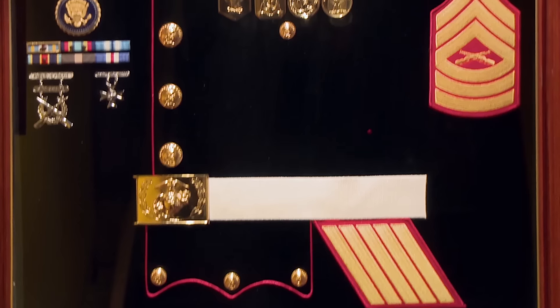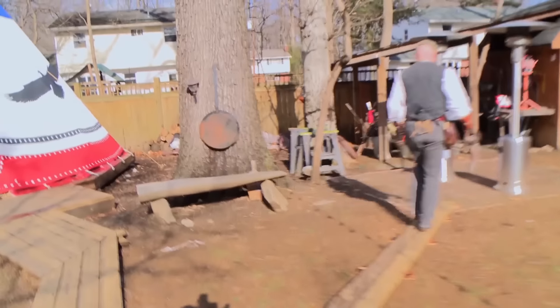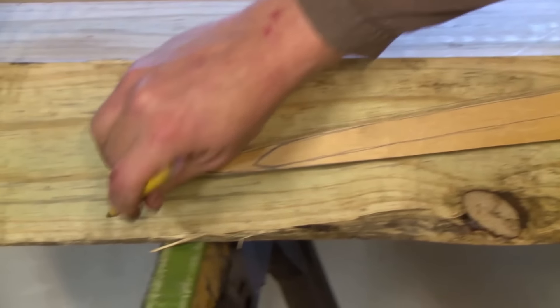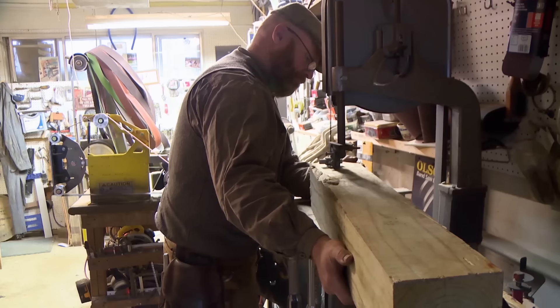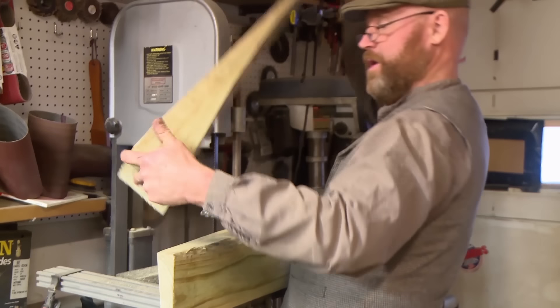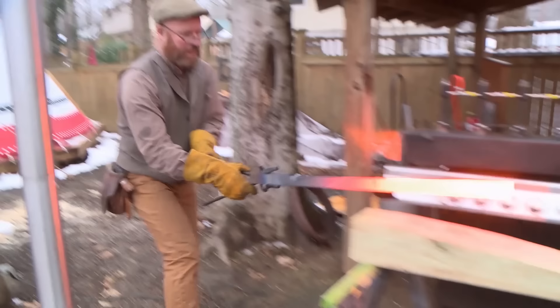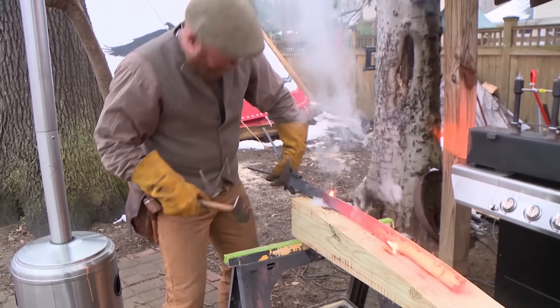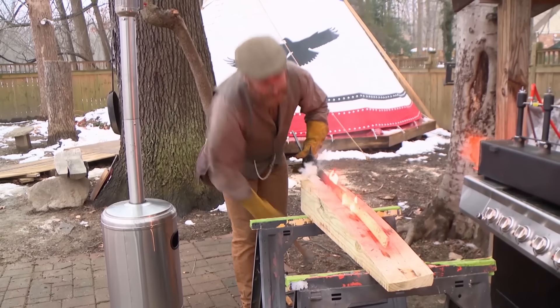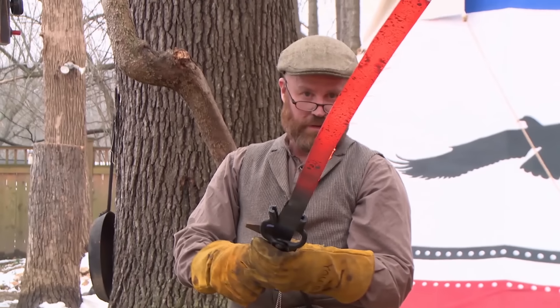So it's day one — I'm back at my home forge in Springfield, Virginia. The more difficult aspects of the build are the parameters — very specific and very tight. Because the parameters are so tight on the bend of the blade, my idea is to take a six-by-six log, remove all the excess wood, and it's going to leave me with the blade shape that I want. I plan on heating up the metal and whacking it on this log so it bends and conforms to it. It seemed to work pretty well — I just jumped four hours ahead of my little schedule.